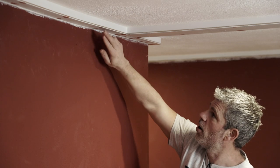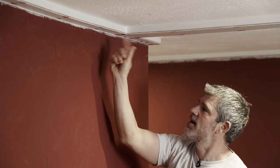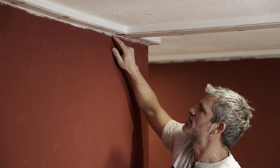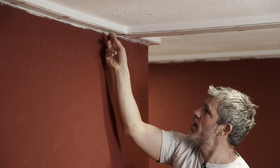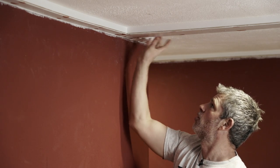Now comes the hard part — the finishing. That means filling all the brad nail holes with Evercoat Everglade spot putty (the red stuff, not a sponsor yet), and filling all the gaps with caulk so once painted everything looks like one continuous beam. All the holes are filled and gaps are caulked. When I made the cap pieces for the trim on the sides, I cut them the exact same width as the channel pieces — that way any wall variance can simply be addressed with caulk and you'll never see it once painted.